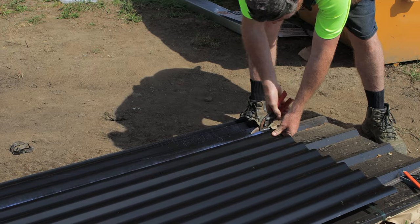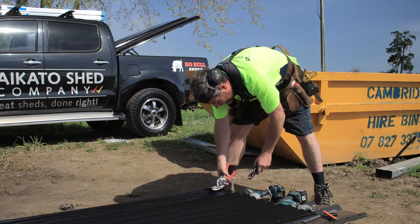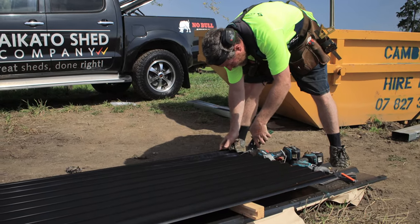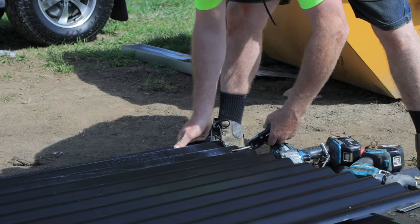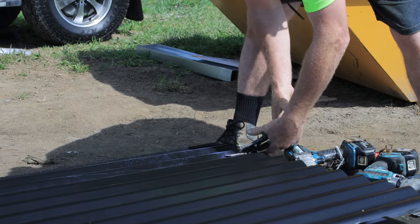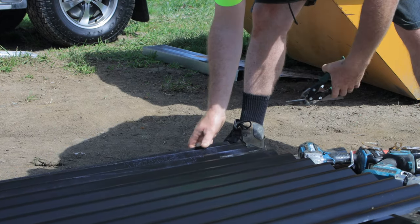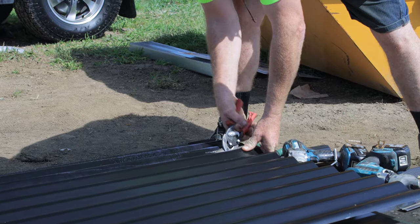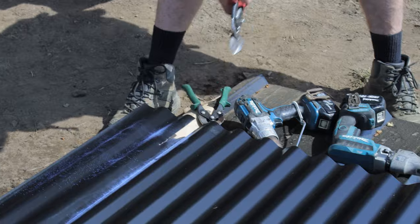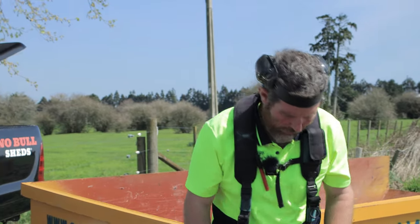Sometimes you have to do two cuts. So now I've got my greens on me. I'll be cutting up and then doing the other cut. So cutting, and then by doing two cuts, I'm relieving the tin so it's easier to get my cutters in and keep cutting. Pretty hard work, but it is doable. And if that's the tools you have, you can do it. Takes a little while, but you can work your way through.